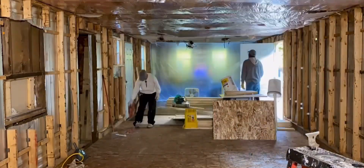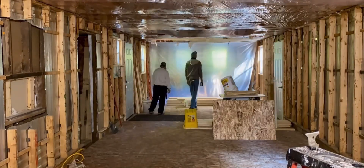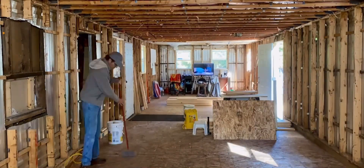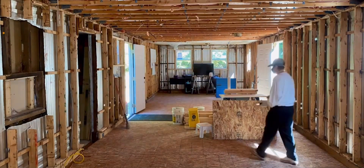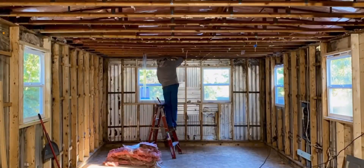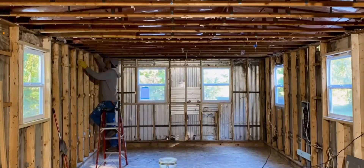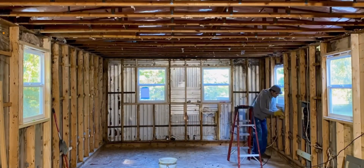Once the floor was in, it was safe to remove the drywall ceiling and insulation, because the previous floor was very dangerous and rotten — susceptible to breaking through, which we did a few times while removing it. Once it was safe we got the drywall down, which was easy, and removed that smelly contaminated insulation. There was also insulation sandwiched between the rafters and the roof with plastic and fiberglass — like a quilt — so I had it meticulously cut with a sharp knife between each rafter and removed while keeping everything clean. All that contaminated material had to go.